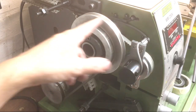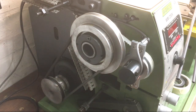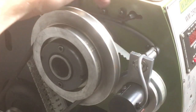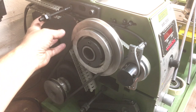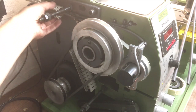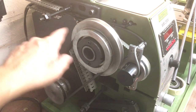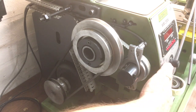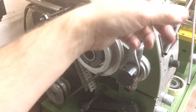The next stage is to get all the wires routed through here so I know how long they need to be, and then I can make the final connections into the box. I've been routing the encoder cable through — got a couple of clamps using existing threads. The display cable goes through that one. I took off the end plate and added little cable guides: one will take three cables because the third one, the emergency stop, will also go through there once I figure out the best implementation. That will stop the servo driving the lead screw and halt the carriage advance toward the chuck.